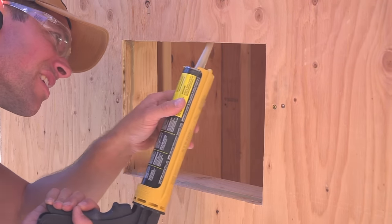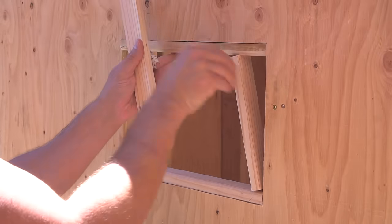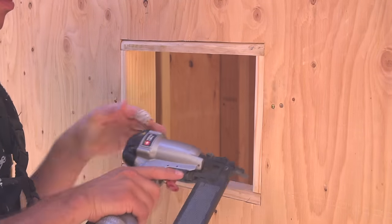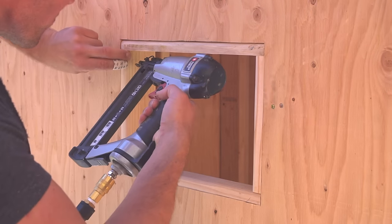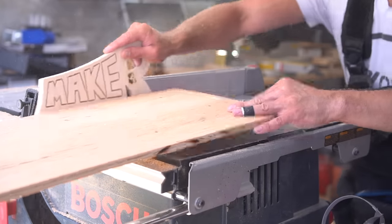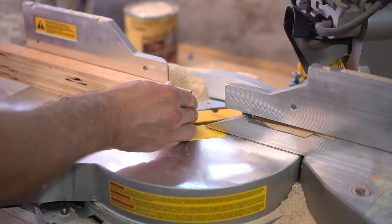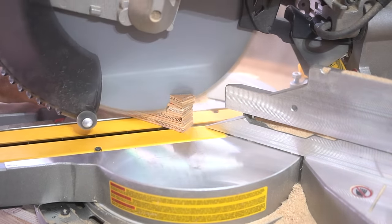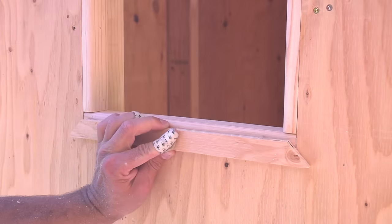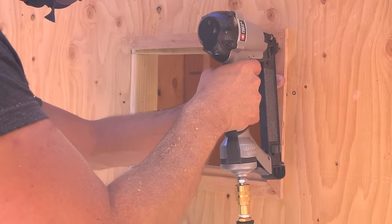I place a bead of construction adhesive around the perimeter and then install our 2x4 trim. This will come in extremely handy once it comes time to actually putting in a window — or at least installing a glass panel, which we can pick up at Home Depot. Once everything is fitted in nicely, I take my finish nailer and nail the perimeter of our trim in order for it to secure properly while the adhesive dries. To reduce our material list and use scrap wood, I run scrap plywood through the table saw at one inch thick, producing perfect trim pieces. I do want a nice mitered corner look around the windows, which is why I'm cutting each end at a 45-degree angle and nailing them in place around the perimeter. I suggest grabbing a level just to guarantee proper levelness and that each side is aligned properly with the other.